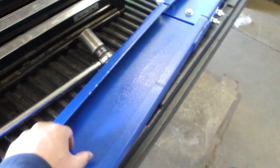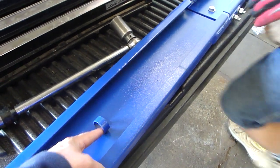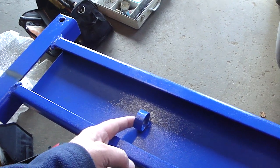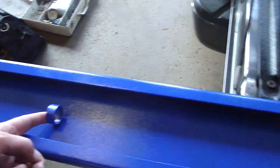These loops will be facing the ceiling. Your hydraulic hose, when it passes from the left side of the lift to the right side, near side to off side, will pass through those little loops inside the upright beam, or top beam.